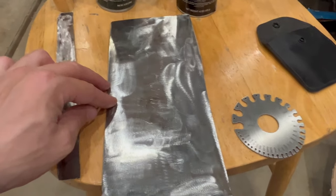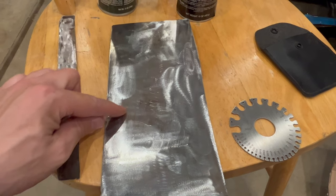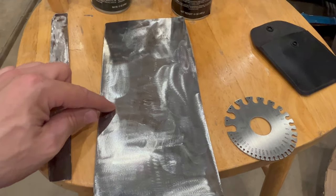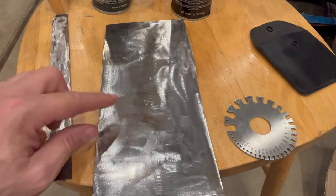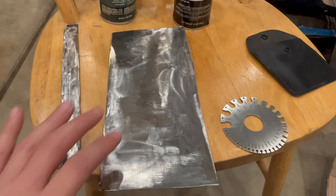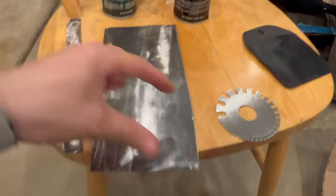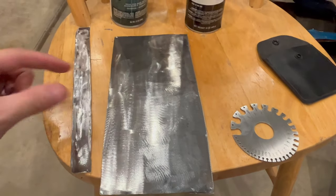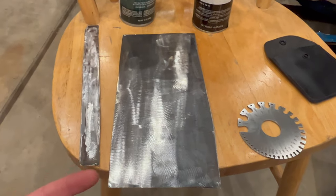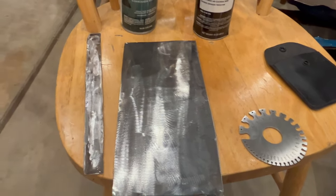The area with the self-etch, what people have said they've done is where you go to weld the holes, once you clamp the other piece of metal in place, clean up where you're going to be welding. So essentially you have the primer all the way up to the weld. Also, on the back side I'm going to put the same primers there so I can see how the heat affected area works, to see if the weld through primer actually does resist the heat better than just a self-etch.